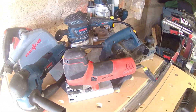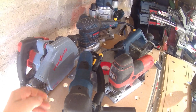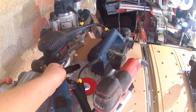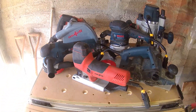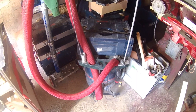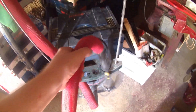Hello all. There's been some interest shown in some of my previous videos about the power connectors I use on my corded power tools, so this video is all about them — including how to fit them and why I use them. They're the Neutrik Powercon True1, a locking waterproof connector, good for 240 volt at 16 amp. I'll leave links in the description. The tools themselves are all fitted with the male connector.